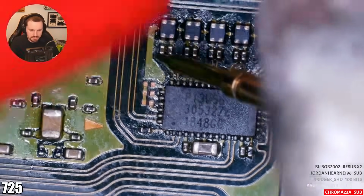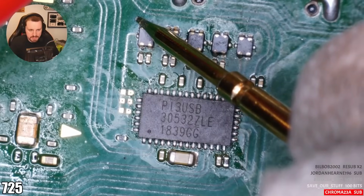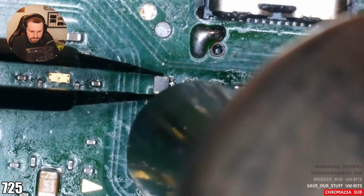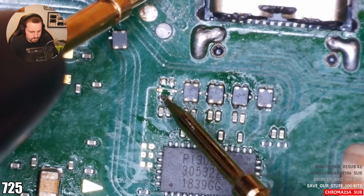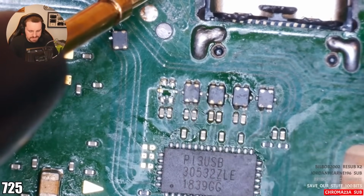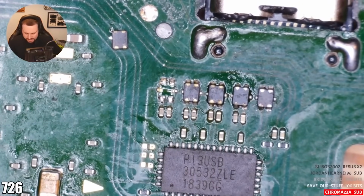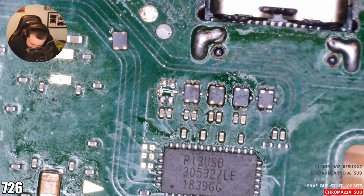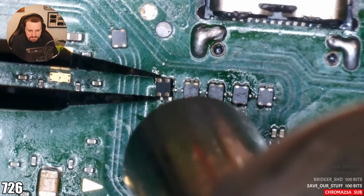And I get 0.4 going to that. Where does this filter go? Is the filter shorted? It's just a bit of wire, right? Like, I don't understand. It's not ground anymore. It's not ground. So it's that filter? Was that the issue? It's weird because I tested them, obviously, but it had continuity through the filter because it was ground to ground. So if that one goes disappearing, by the way, I'm not too fussed about it.